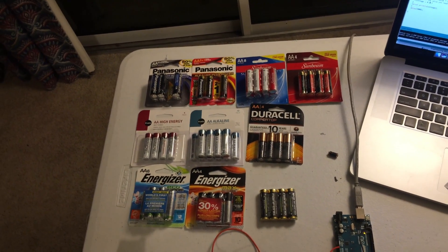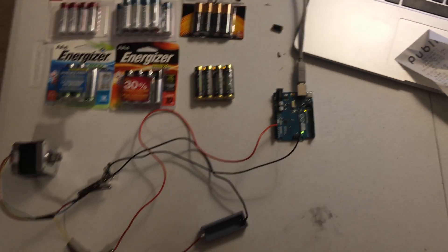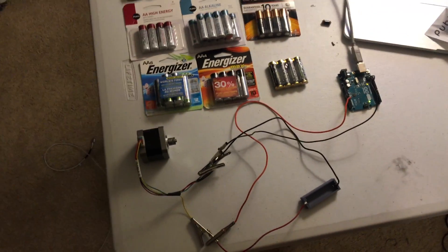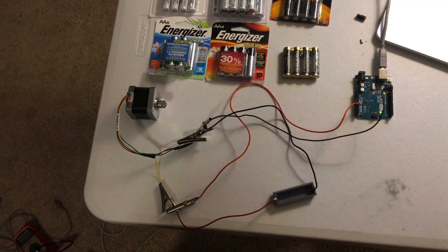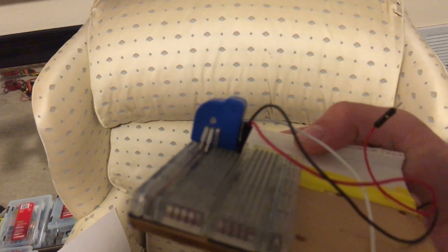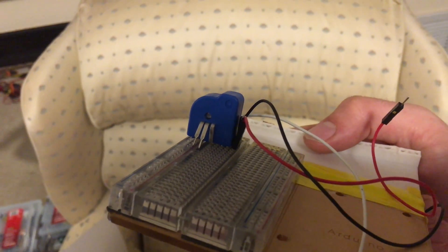Typically people put batteries in a flashlight and record the amount of time, but I wanted something more accurate. I have my Arduino here and I'm using a stepper motor as a controlled resistance. I tested it — running 1.5 volts through it for about 10 minutes — and the resistance stayed at 6.1 ohms. I was going to use a current sensor I dug out of my closet, but it didn't sense a small enough current for what I'm trying to do.